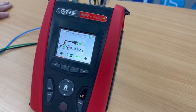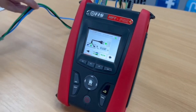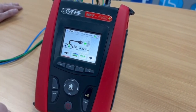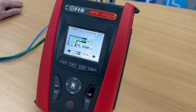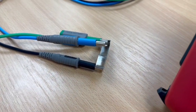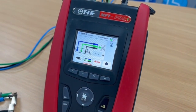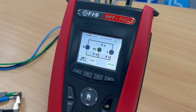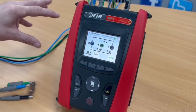We've talked about zeroing the mains lead when carrying out a loop test on the MFT Pro and MFT Pro Plus. We've also got a similar situation with the distribution board lead set, which on our unit is longer than normal. We need to make sure we're not including that resistance in the overall circuit, particularly again for ZE when we're really close to a substation with exceptionally low values of resistance. We now tell it that we're going to zero the distribution board lead set — still using the little spring adapter, this time configured with the 4mm connectors. It's telling me the leads are currently unzeroed, so we press zero: 0.038 of an ohm for that lead set. Thumbs up — back we go — confirming that the leads are zeroed and we're now good to carry out our loop impedance test using the distribution board lead set with the leads fully compensated.